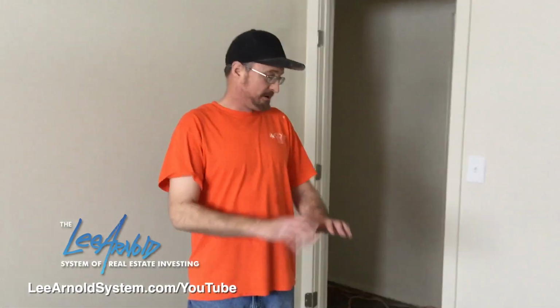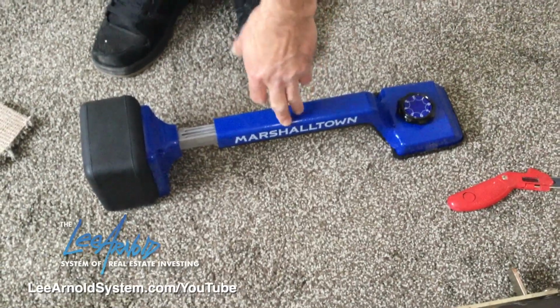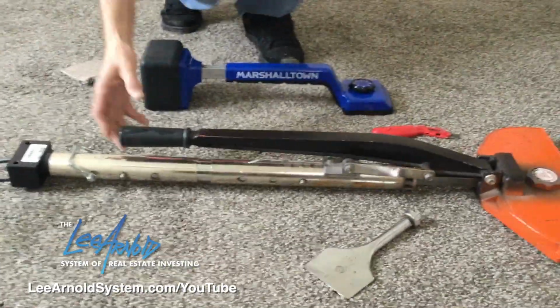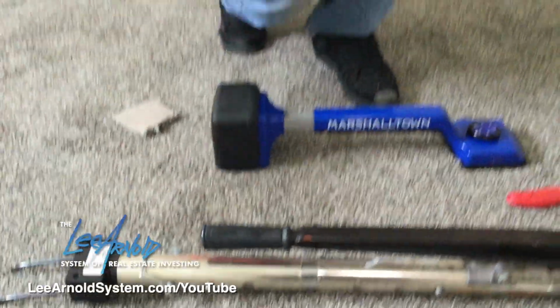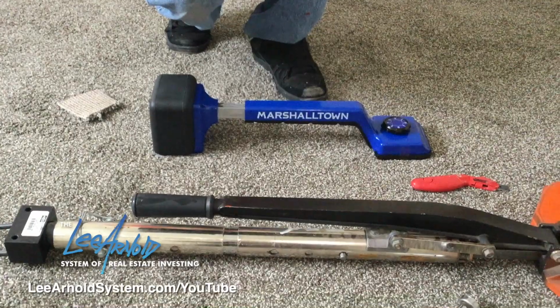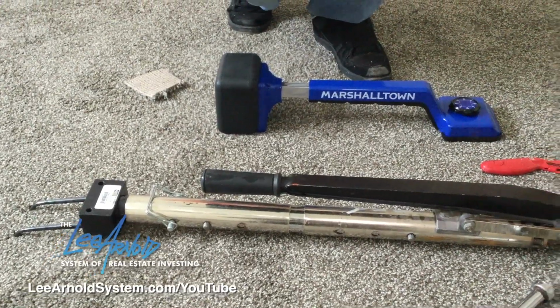Okay, so now we got our carpet laid out and we got a rough cut in. So now we will set the carpet and start stretching it. The tools that we'll use, we got our knee kicker. That was used for many, many years. Then they came out with the power stretcher. The power stretcher will come in a case, and it'll have poles like this. With this is a stinger. So we use this on wood floors. You can't use that on concrete floors because it's just going to keep on sliding onto the concrete. So if you have the poles, then you go from wall to wall stretching. But since we got wood floors, we're gonna use the stinger so we don't have to hassle with all those poles, and we'll be good to go.